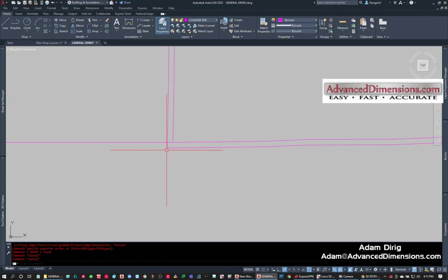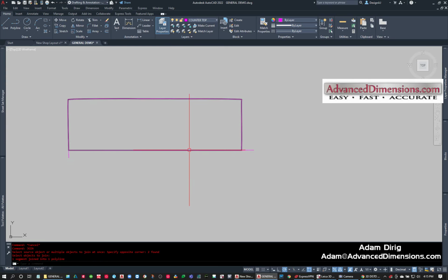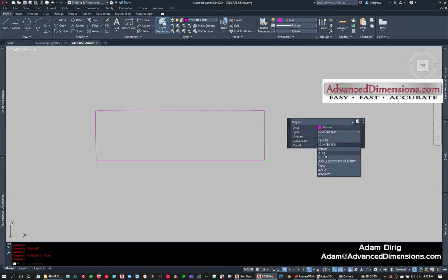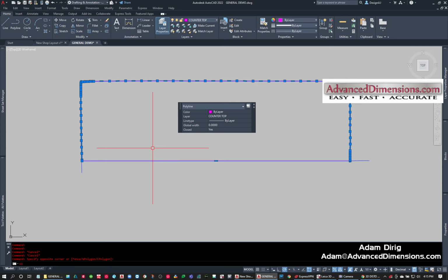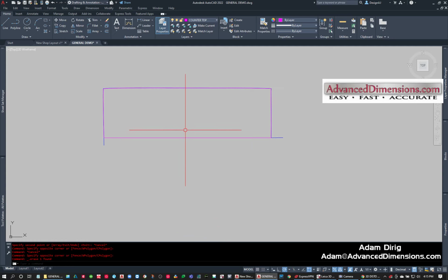Okay, and then I'm going to do, again, some trimming CAD work here. Everything that I do here, I've done in other software too. So actually now, this is what I would cut my countertop to, even though this is the wall. So we could actually change this to walls again. So this purple or pink, I would copy this, and that's what I'd cut on my CNC machine. And now when I get to the job site, that will literally just fall into place.